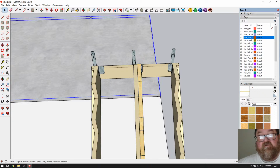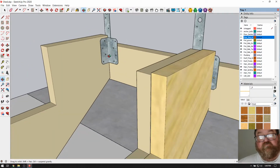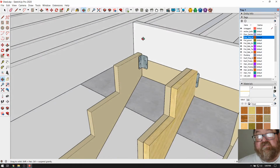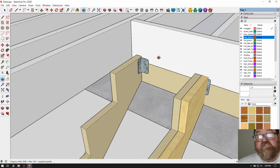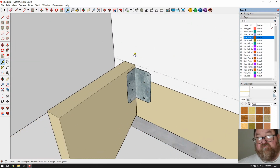Okay. You got these right here. And let me turn on the decking, floor framing. You see this white is the existing 2x10s up there. But because you have to come down this dimension, this is the other dimension you're going to check. It just occurred to me, you need to know that this is 7 15/16, okay? So what you'll do is you'll measure down and put yourself a mark, 7 15/16, okay? Put yourself a mark across there.